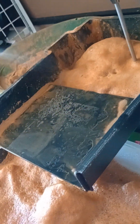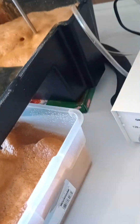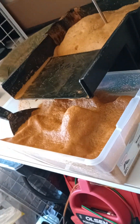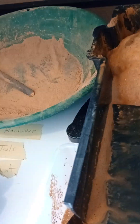If you're trying to get nickel you use a different chemical. If you're trying to get copper or gold you use the sodium ethyl xanthate method. When the froth goes all the way down, that's when you need to add more pine sol.